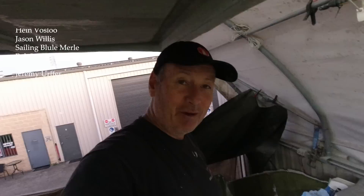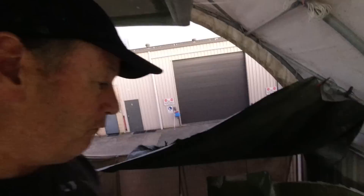It's just on dark and that's taken pretty much all day to get those layers on — that 1280 quad with the CSM on it is an absolute son of a bitch to put on. The issue is if you don't have enough resin underneath it you just have to keep working it, but what you're getting is five layers in one — it's an amazing product. That now has six effective layers, around about twelve layers total, about six millimetres thick so far, and I haven't even put the foam on yet. I'm not going to worry about foam on the stair module section as that's going to have a lot of reinforcement.